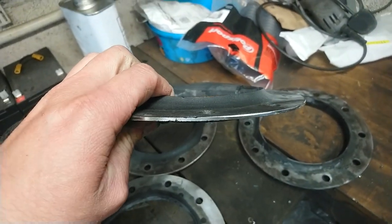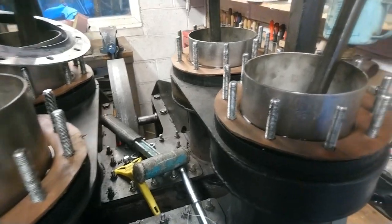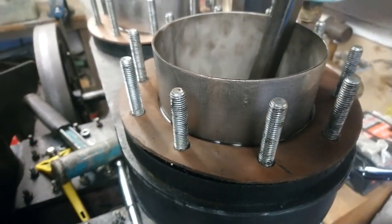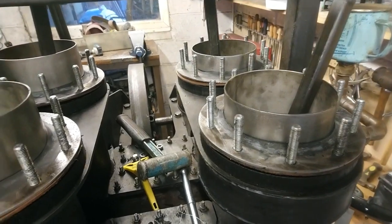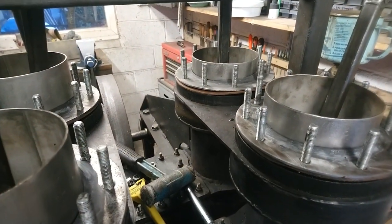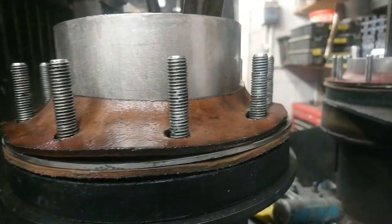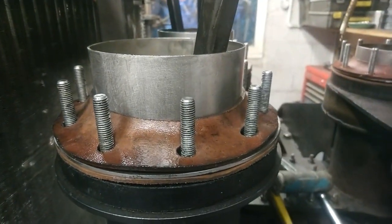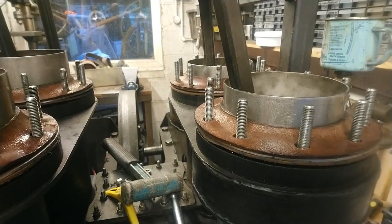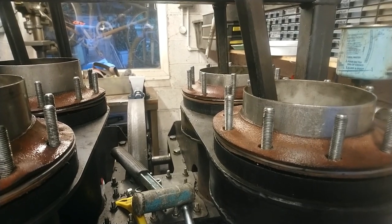I'm going to give them a little sand down and then fit them. I'll put the four seals back on and put some lubricating oil on the seals before I put the next piece on. So there's our support rings in place. The top seals are now in place — notice that these lips point upwards. The point of these is to stop free oil flow into the cylinders and also to stop dust getting in, which is pretty much taken straight from the Alexander Ryder patent.